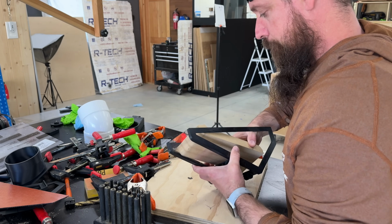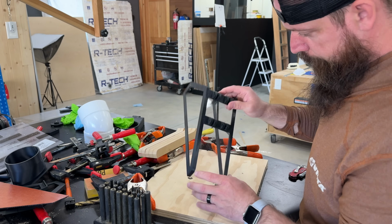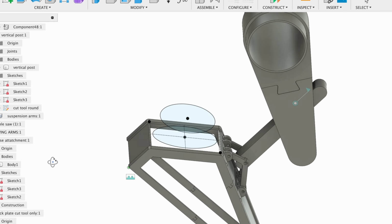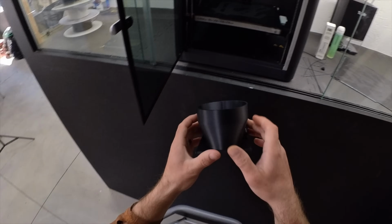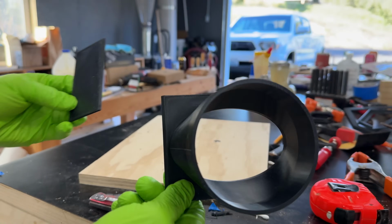Before cutting out and attaching the polycarbonate sides, I had to design and attach the air hookup plate to accommodate 4-inch duct. This was a battle of footprint restrictions and not sacrificing air volume. The workable width of the dust hood is roughly 3¼ inches, but I'm using 4-inch flex hose, and that's a slight problem. So to accommodate this, I lofted an ellipse to a cylinder to keep the maximum air volume unrestricted. And wham bam, I have this custom 4-inch hookup for the dust hood.